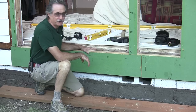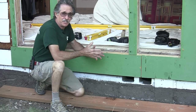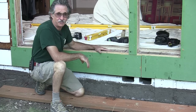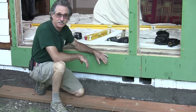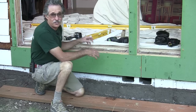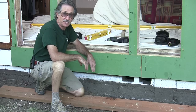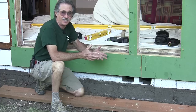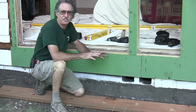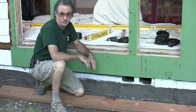I'm about to put in the French door and the two side lights into the master bedroom. Usually for a window install like this, if you go to a trade show, you'll see that it's really simple — you just prep the sill with a cant strip, put your sill pan in, put a bead of sealant on the back of it, and set your unit. But life is never as easy as at a trade show, and a lot of new construction jobs are almost like that too, where everything's fairly level and straightforward and you don't have to deal with the kinds of problems we run into frequently on a remodel.